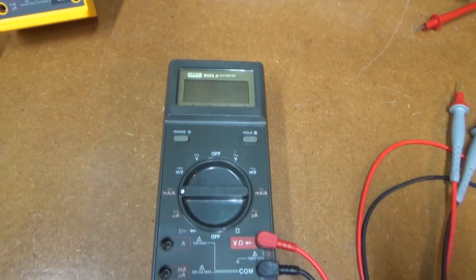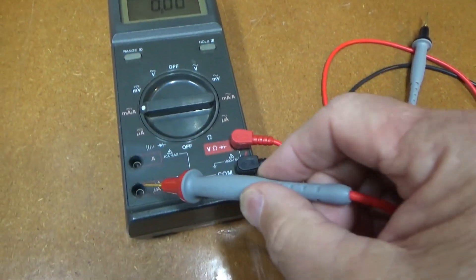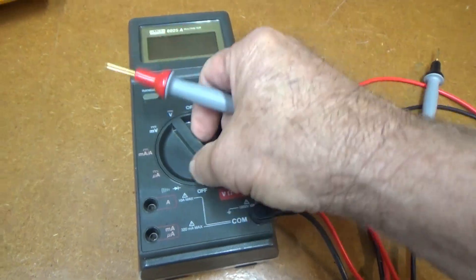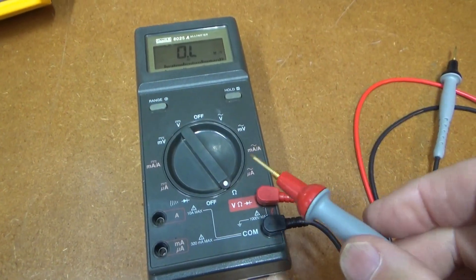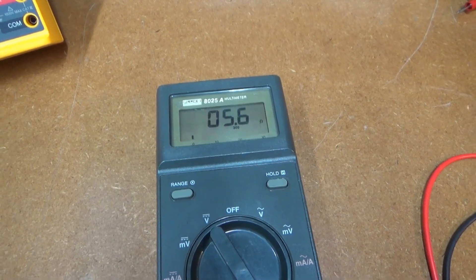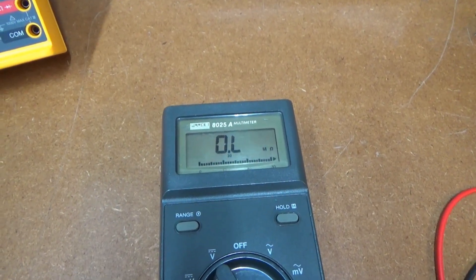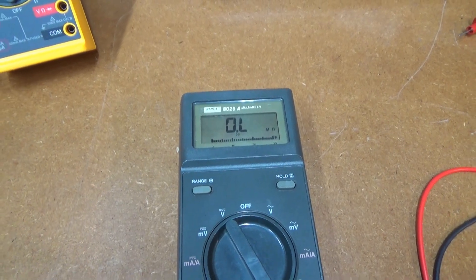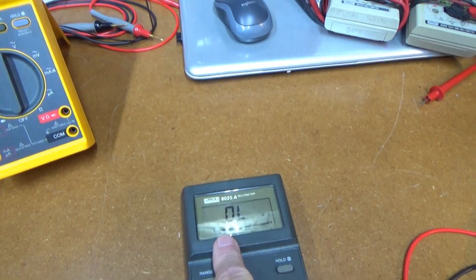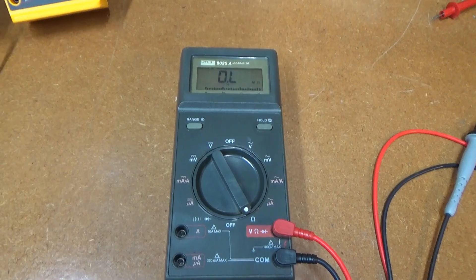On amps, here's a good way to test your fuses — see if they're good. Just take the positive lead and plug it into both of the amp settings when it's on ohms. On milliamps you should read a low resistance; on amps you should also read a low resistance — but not. So either that fuse is missing or blown on the 10-amp range. We've got a bad fuse, a display that needs repairing, and something in all the AC ranges is messed up. So I'll take it apart and start taking a look at it.